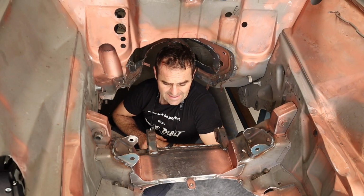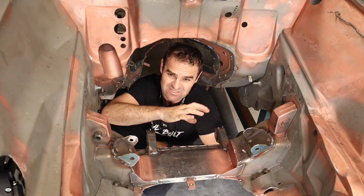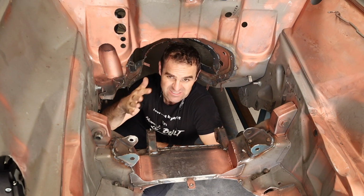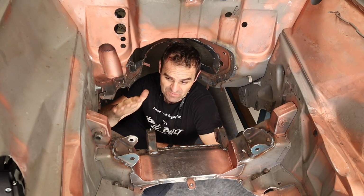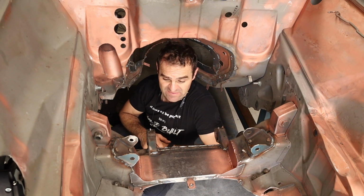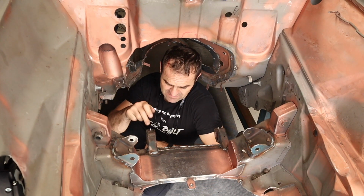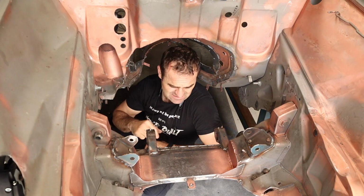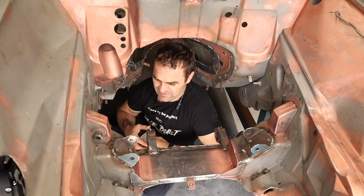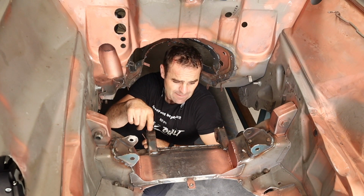All right, so moving on, I've just gone through and I welded up the engine mounts, because I had them bolted on, and that's just the way I did it at first. There's no reason for them not to actually be bolted on. They can quite happily be welded in place. That's where they need to be. I also did some more finish welding around the steering rack mounts. It's not pretty. It's quite difficult to get in and weld, but there's plenty of penetration there, so it's quite good.